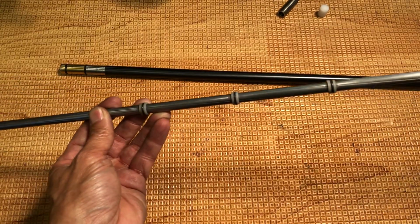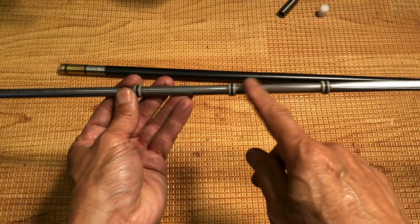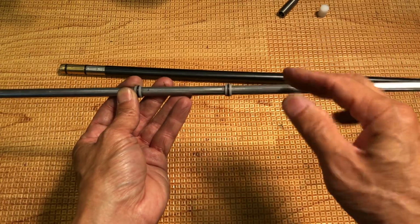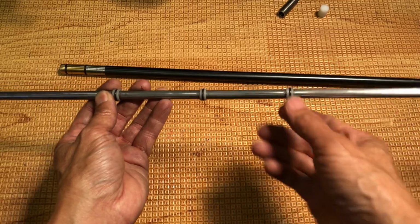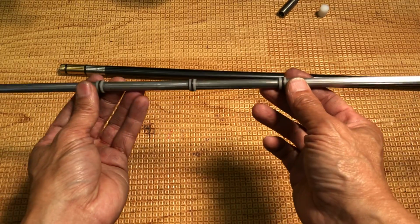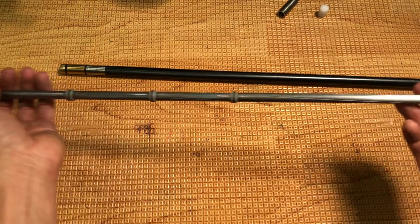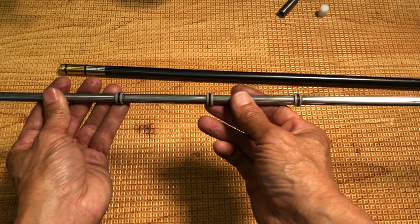You know, every time I pull this liner out, all these O-rings don't stay. Well, when you put it in, it's kind of a blank shot because you don't know if this O-ring moved. Because I want this O-ring centered, because that's the only area it's not fully supported. It's subject to vibration and flexing.